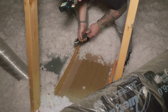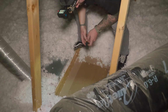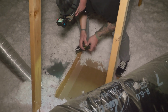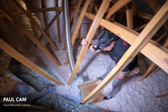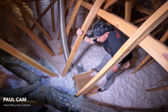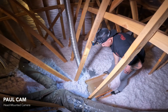Now, you say our product doesn't have any framing required, and in these cases it looks like we're going on sheetrock only. There are instances where we can put it up against the stud, assuming we don't have another grill that we could overlap, or assuming we don't have barriers against the joists like on our central fan with the wiring. We're okay to be able to put the damper box on sheetrock without securing it to a stud? We are. We've got 4 plaster grounds that are attached to our damper box, and those will just rest right on the drywall itself. Okay, so against a stud or on the sheetrock, both installation applications are okay.